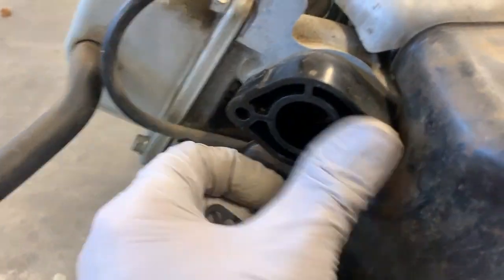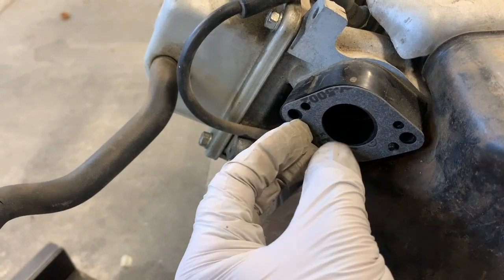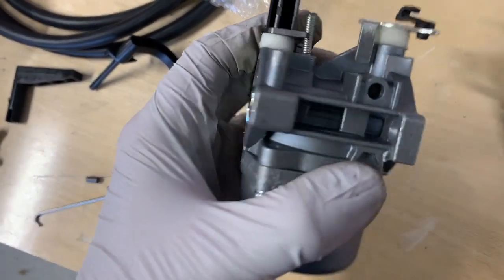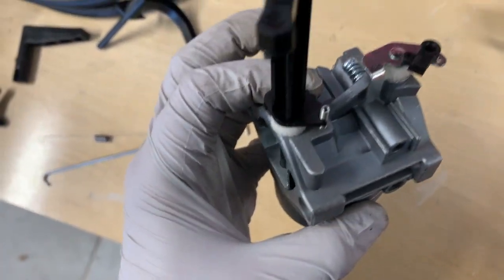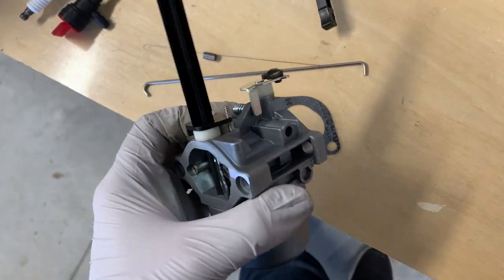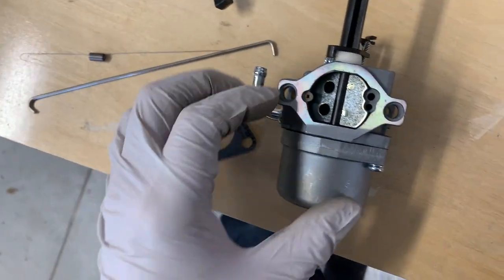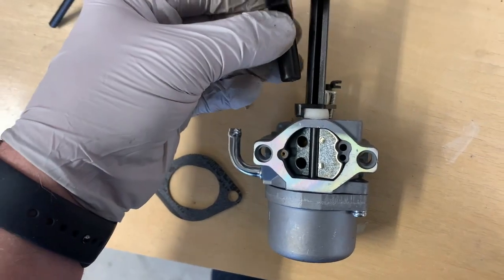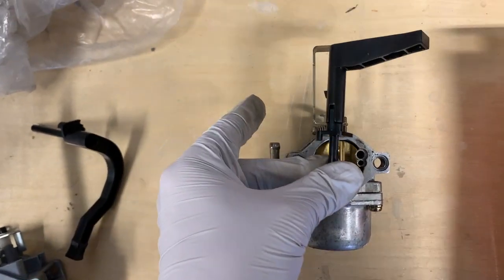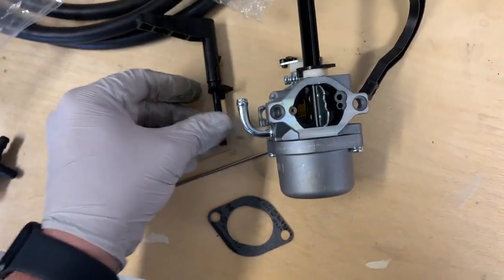Here's where I got all the rest of my gasket scraped off — everything's nice and clean, so this will be the first guy back on there. What I'm going to do is put the primary and secondary throttle or governor linkage into this new carburetor here. Then since I have the arm off on the engine, I'll just hook it up there when I'm done. First I'm going to figure out which cap I would need.